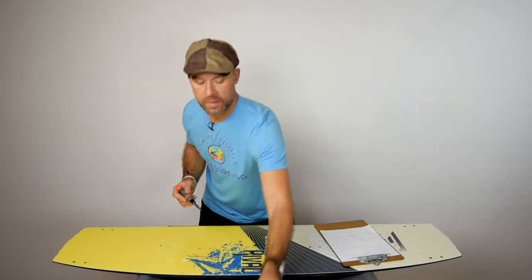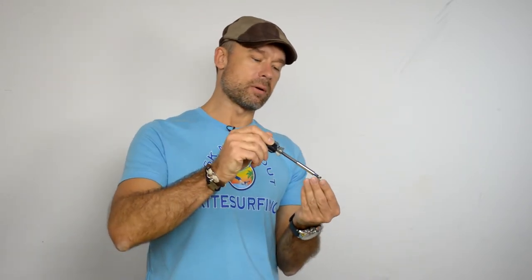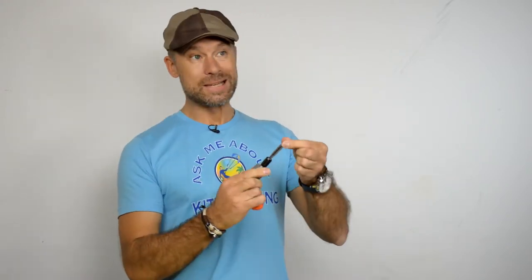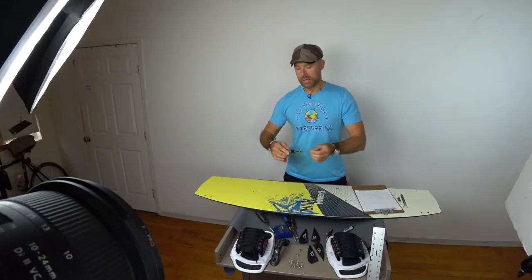The reason for the right tip size is that it should fit snug in the screw head. Also, these screws are made of stainless steel, and stainless steel is not magnetic. If you're used to holding a screw with a screwdriver and it stays put — that's not gonna be the case here. If the fit is not perfect and there is wobbling, the screw won't stay with the screwdriver. You'll be better off if the tip fits perfectly inside the screw head. This number three fits the screw just right.